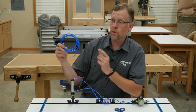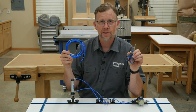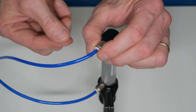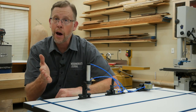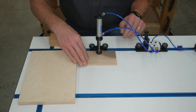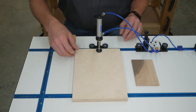You don't need special tools to install this four-millimeter air tubing either. Just cut it to length with scissors. Push the end of the tubing into the quick-connect fittings until it stops to install it. To disconnect, just push on the blue or white spring-loaded collars and pull. These clamps produce about 34 pounds of pressure, either downward or horizontally, and they automatically adjust to workpieces of different thicknesses up to about two inches without any adjustment required to the regulator.